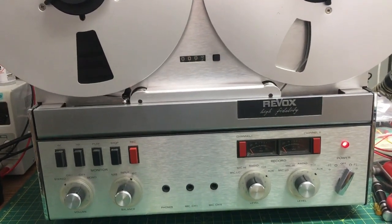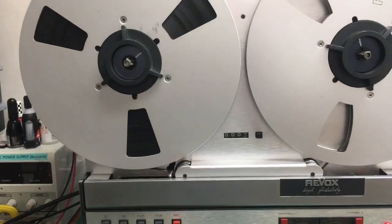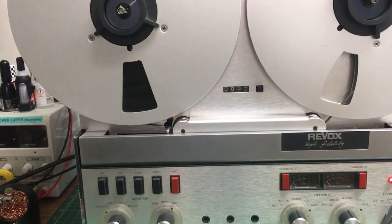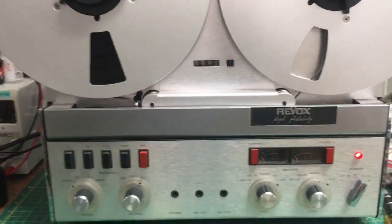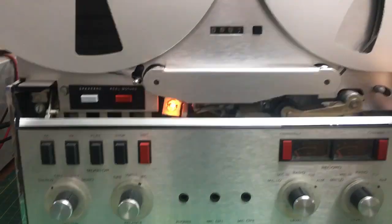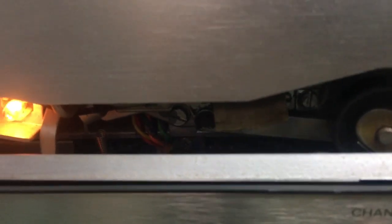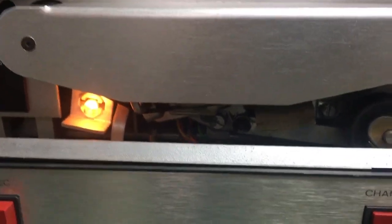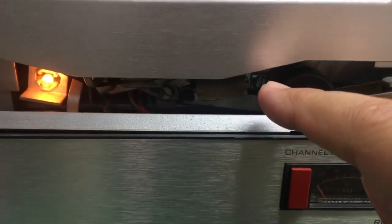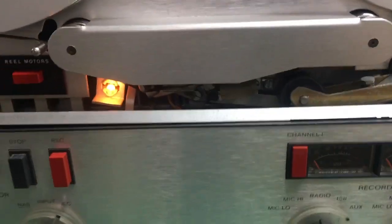But you know what I did earlier on? I put the tape on afterwards, and it wasn't playing. I thought, what the hell? There's nothing on the tape. It can't be. Well, it was. I'm an idiot. I must have accidentally threaded it underneath the cover there. See that little flap? It was threaded on under there. Oh, what a twit. And when I rewound it and looked underneath that flap, you could see it was a little bit cleaned off. So that's where the tape was rubbing.